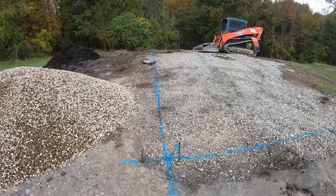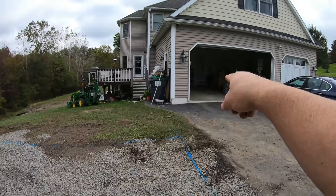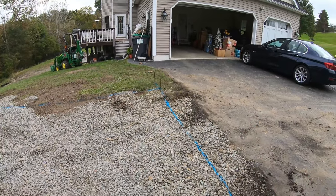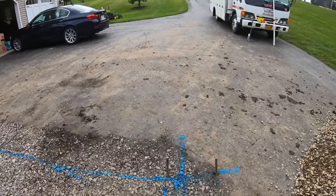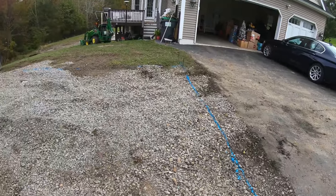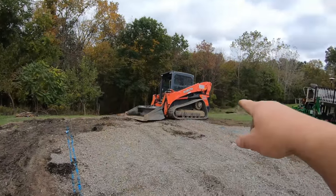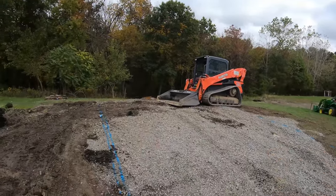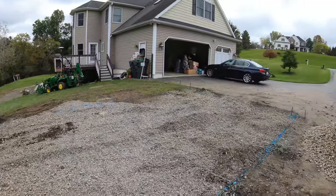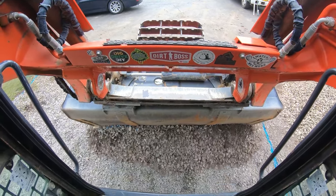All right, got everything painted out. That's my box out, shot elevations. We were originally going off the top of garage floor. It would be top of garage floor here, but after shooting it, it's way too high. This top of the pin is the top of that garage, which is about 10 inches. And back here it was 2 feet, so 2 foot difference from that top of the garage to there, which by eye you would never think it. I would think half that, but that's why you gotta love the lasers. All right, let's just back drag some stone.